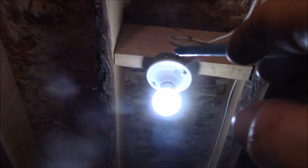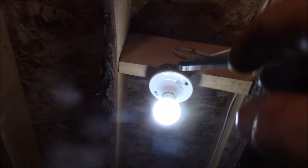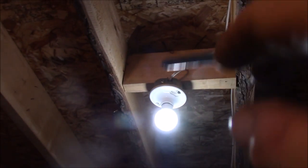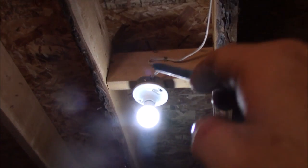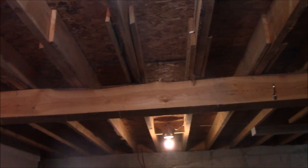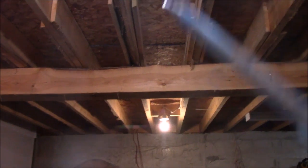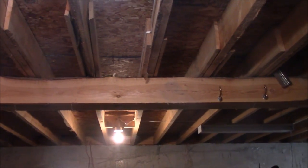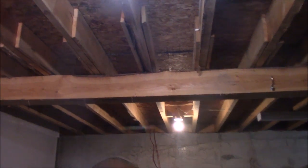And when I did that, and I'm gonna do the rest too, I ran the wire down, and then I pigtailed two wires. The white and the black, I pigtailed them. The one running from that light to here, I pigtailed them together with a wire that runs down into this light. I'll do the same with the rest. I will run the wires down, and I will pigtail a little wire that runs down to the lights. And then I was reading, and that's a great idea, and that's probably even code here. I don't know. It doesn't say anywhere in the book I can find.